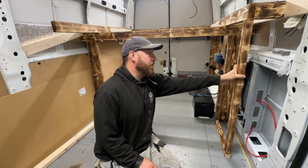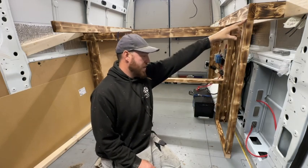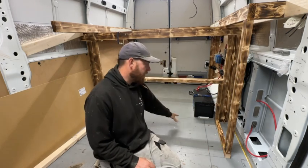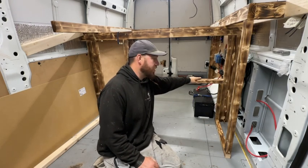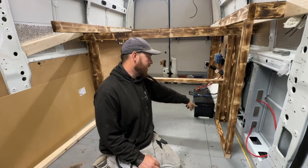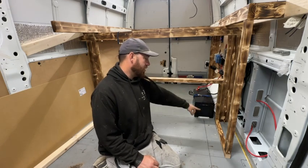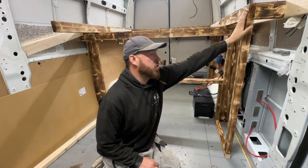I've already started building it by putting in this support here, which doubles up as a structural support for the bed, and I've put it on top of this rail so we spread the load. The same with this one here. This is the back of the bench where the ply sits. On this little bit here, again, we have a component going down to spread the load onto this cross beam. I've also tied it into the wall, so this corner is nice and strong now.